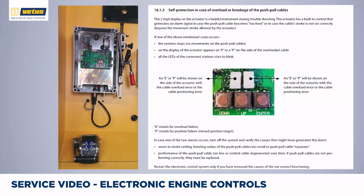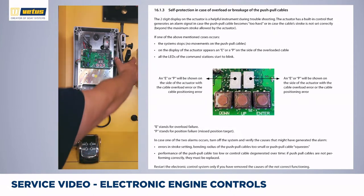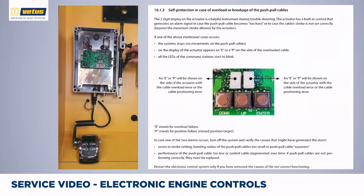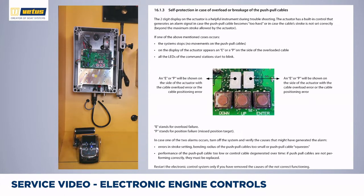If the obstruction was found close to the end position it would take longer; the levers would still respond but typically the system goes to a low power setting. In this case the system doesn't respond to the control lever at all. Switch off power, go into manual mode to release the object — there will be a lot of stress in the system. Turn the knob until it is manually released, then rotate the knob counter-clockwise to go back to normal mode. Move the control lever up or down until you feel it latch and click. Apply power again and the system is fully functioning.